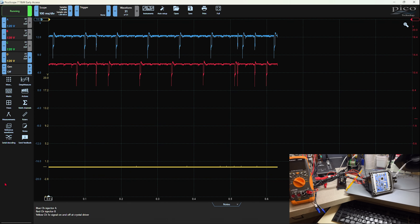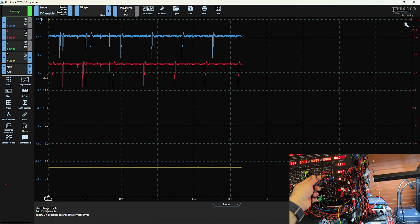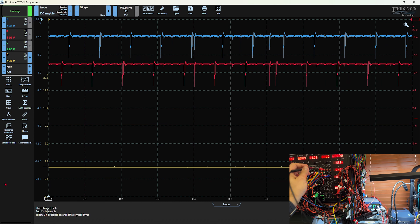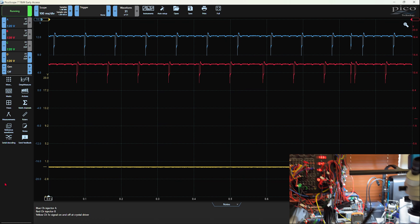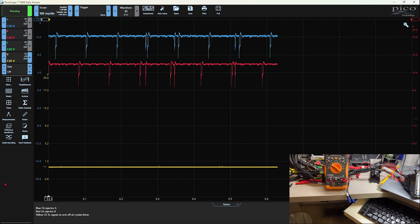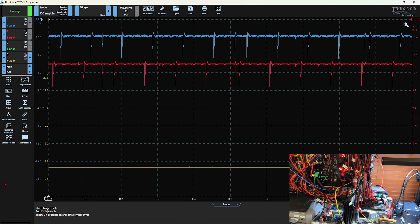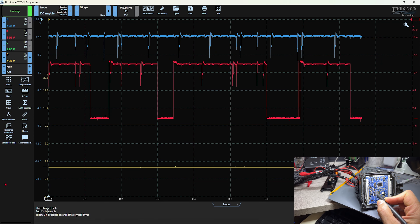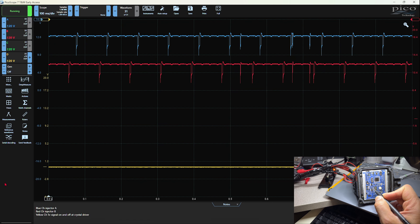What I'm going to do is provide 5 volts through that same path in there and you will see the result. I'm doing this through a resistor test light so it's not full voltage going through. Even though the computer is bad, I don't want to damage anything — just in case I touch a ground or something I won't burn my fuse inside my simulator.